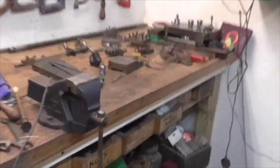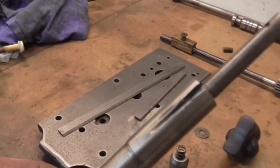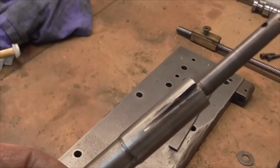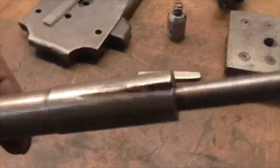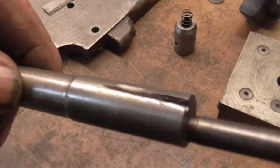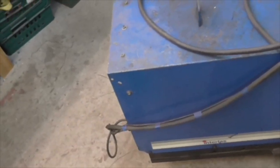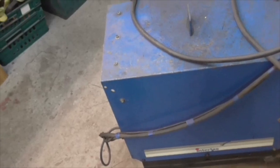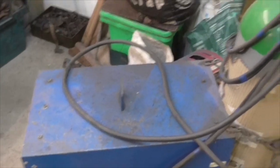Morning folks - the pin is out. Not by courtesy of the milling machine, but by courtesy of a very fine slitting disc on a tiny little angle grinder. The next job is to TIG that up and re-drill it. But there's a problem: the TIG welder's internal gas valve is leaking. So the next job is to take the bottle off, take the top off, and remake the end of the pipe or fit a new pipe to stop the gas leaking away.